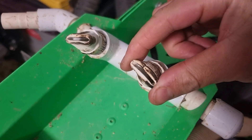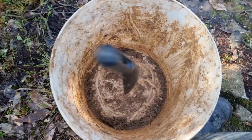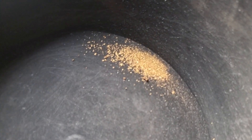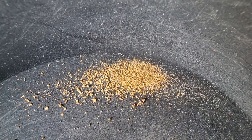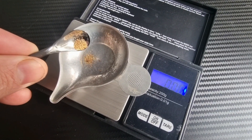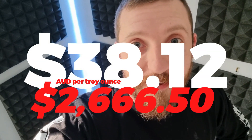Since doing that testing day, I have added nice flat spray bars, and these make a world of difference because the water comes out in the shape of a fan as opposed to a big heavy jet. Those fans of water break up clay balls as the clay goes down the run. And I've added a piece of Miner's Moss at the very top of the run — that creates a dead zone where the material falls onto it and has to stop for a second, allowing gold to sink to the bottom and the material to start stratifying. And that there is all the gold we recovered in five buckets from the drift mines — couple of nicer flakes, even a little roly-poly bit, but most of it is super fine. 0.45 grams of gold is worth $38.12 Australian, or around $7.60 in every single bucket, which is a reasonable amount of gold to have collected in just a single bucket. Please give your dog a big scratch behind the ears for me. Peace, and I'm out.